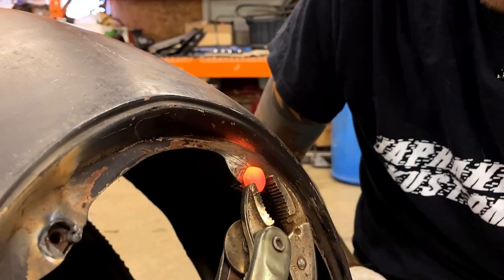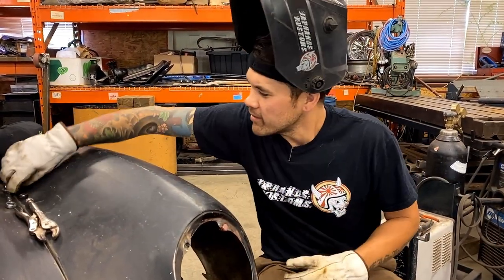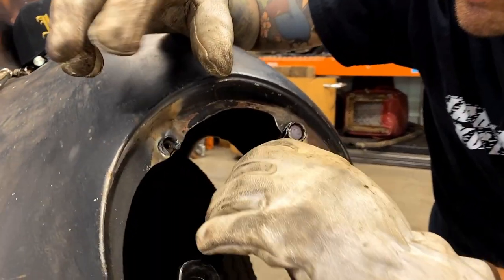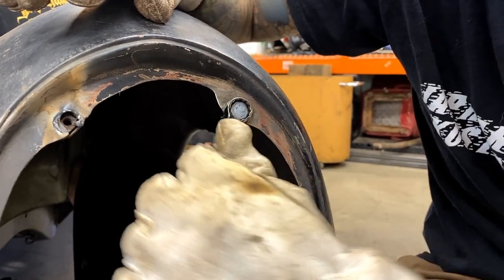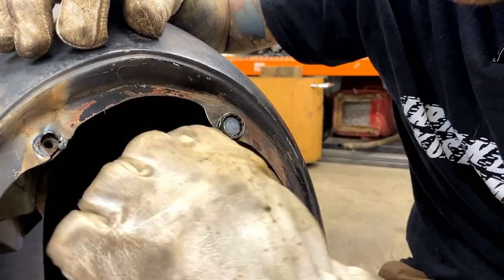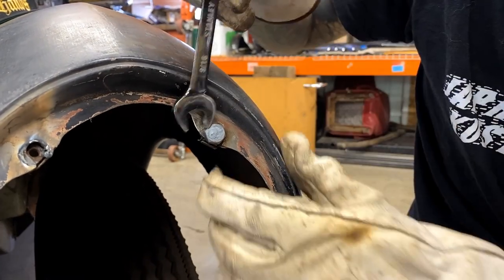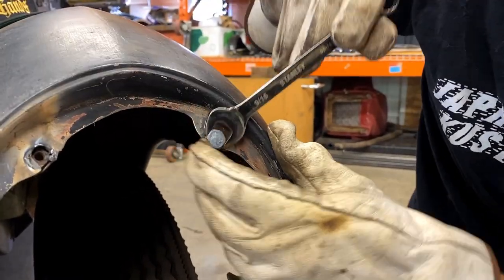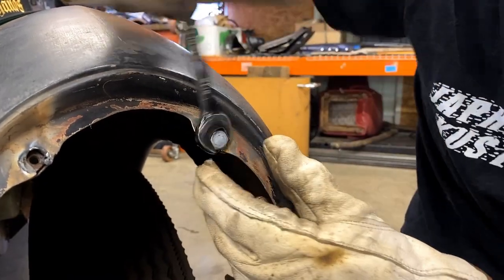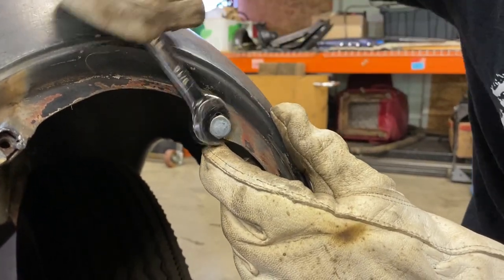There we go. I'm going to wait for that to cool just for a second so that the expanding and contracting can break apart the rust inside, then everybody cross your fingers. I can feel it twisting. Just go a little more each time, give it a wiggle — a little more, give it a wiggle, a little more, give it a wiggle. The stud's coming out! I wasn't sure this one was going to come out as easily as it did.